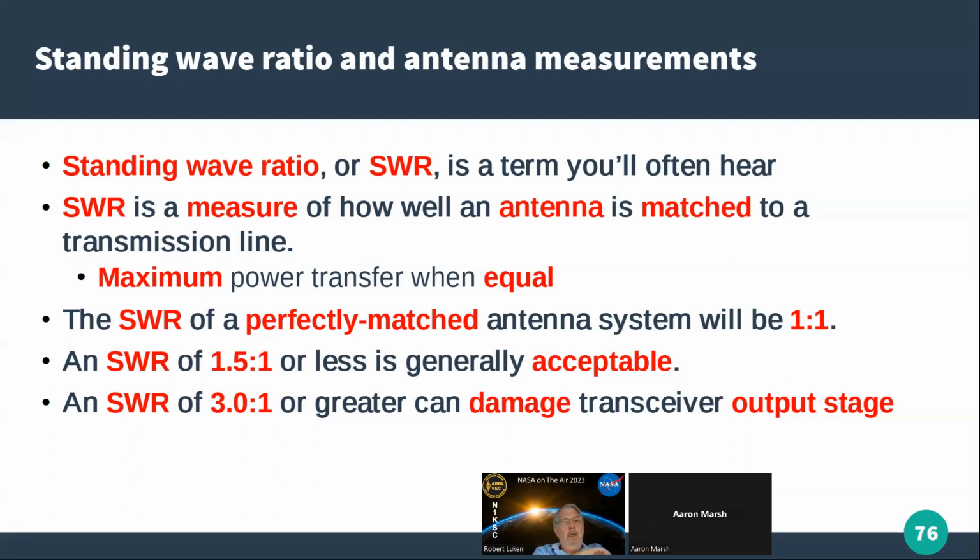Is that frequency dependent though? It is on the antenna, it won't be on your transceiver, or on the coax. And the reason I say that is because coax has a characteristic impedance. In this case, we're talking 50 ohms. When it's matched. When you're not feeding a 50 ohm coax into a 50 ohm load, its characteristic impedance can change a little bit because it's all based on a matched impedance. And it gets really complicated. It's modeled with a whole bunch of inductors and capacitors along there.